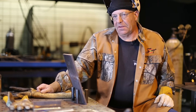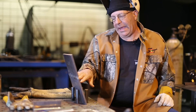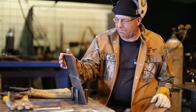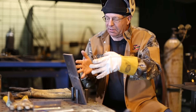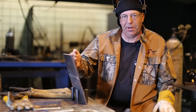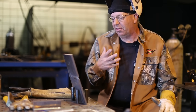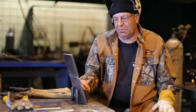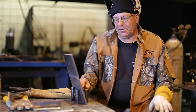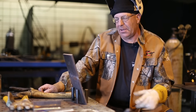Even after running the beads, I got to thinking — I could fill up a groove weld. I've got a 3/8 plate. I ran a root pass in with short arc and I'm going to stack it up here. It's leaning over probably 5 to 7 degrees so we can get a camera angle on it. I'm going to stack two fill passes in this groove, then probably come back with three beads for a cap — just to see what it'll do. I see speed, application, doing some nice hot work and controlling it. That's what pulse MIG is all about — speed and productivity. I'm dreaming about outside corner joints, slightly downhill, getting some speed and keeping the heat out.